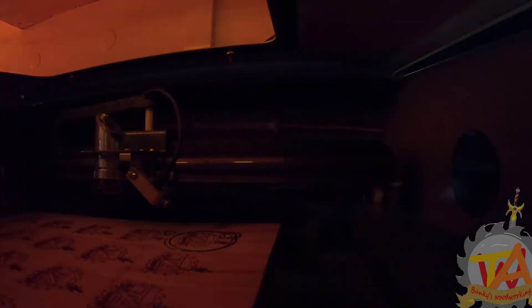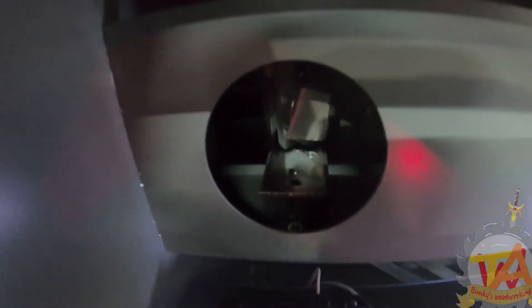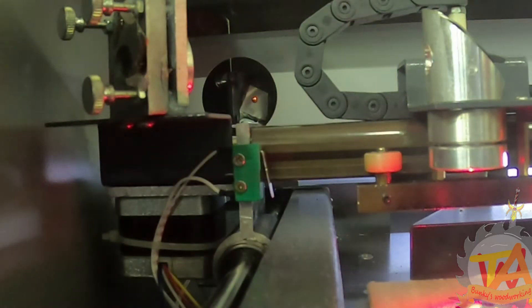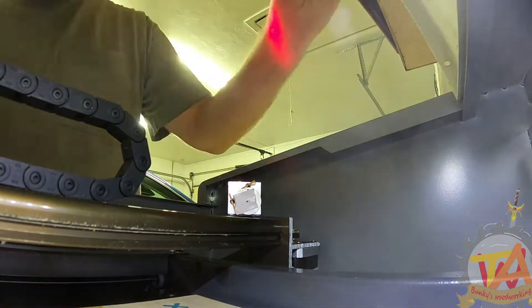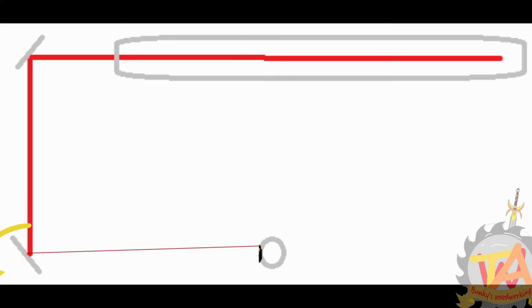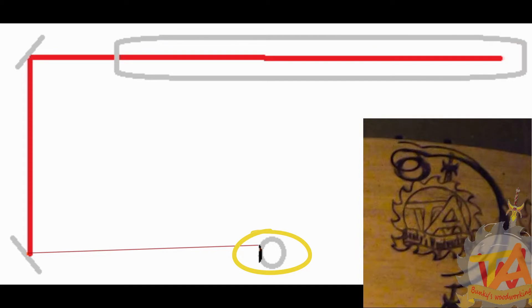At this point we really had to roll up our sleeves and get down to the nitty-gritty. We ended up using the tape method in order to find the alignment of the beam and figure out what was off. Tim, tape method — that sounds scientific, can you tell us more about it? It is when you put a piece of tape over each of the mirrors in order to pulse the laser and find out where the laser is hitting on the mirror. We repeated this method for all three mirrors. Come to find out the second mirror was misaligned — the laser was quite a bit off. The misalignment of the second mirror caused the laser to hit the edge of the aluminum housing on the third mirror, which caused the double image.